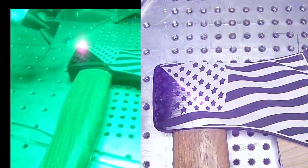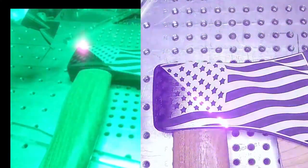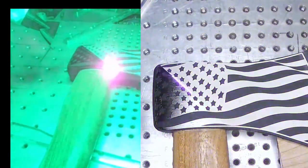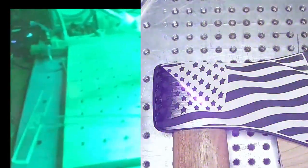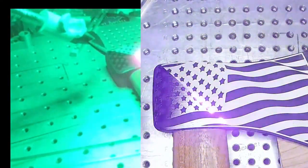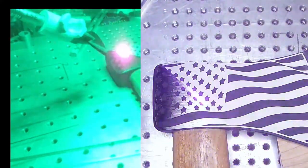SDQ, if you accidentally forget to turn it off, it doesn't appear that it's affected the annealing. Just from my experiment, definitely, especially with general anneals like this. But when you're really going to want to be careful about that is when you're trying to get specific colors with annealing. It's very, very temperature sensitive. So the second you start changing the color of the metal, you're going to start creating more headache for yourself. But I agree with Patrick for this, for general anneals.